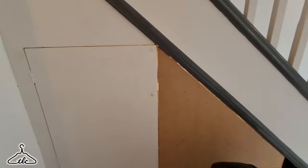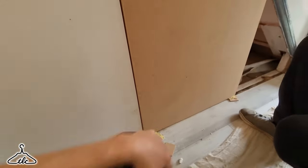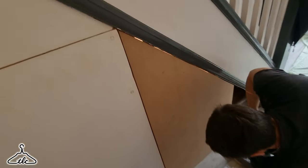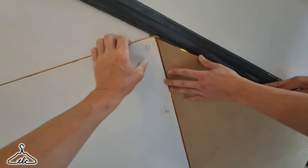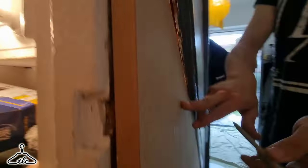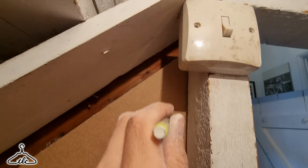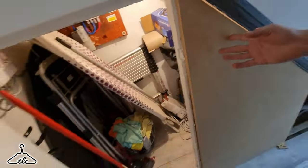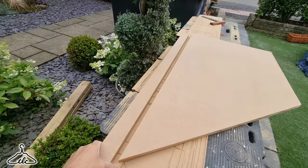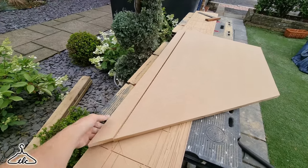Just getting our lines lined up. We've left 9mm at the bottom because we want there to be enough room between floor and door so if there's any dust or dirt on the floor it won't prevent the door from opening. We've got a 3mm gap at the top. Now with the frame behind, we simply mark the frame with a pencil line all the way down to the bottom, then we take it off because we need to cut the strip. So we cut that piece off going by our line so it should match up with the door exactly once it's pinned onto the frame and the door is hung.